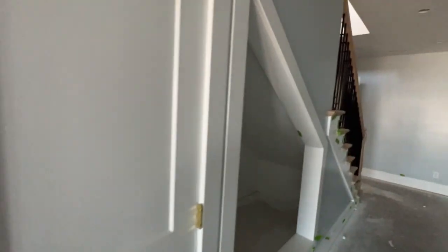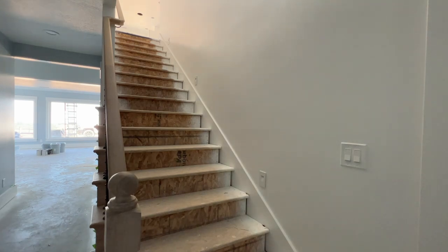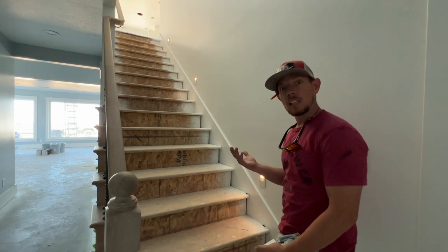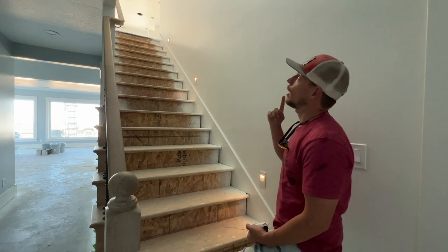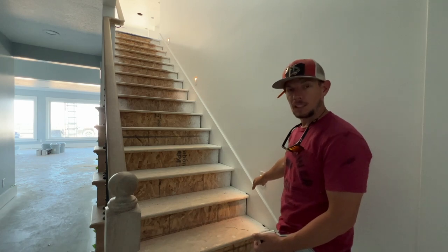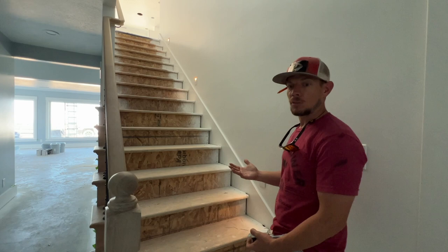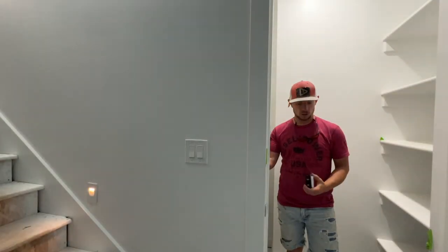The whole reason I got this switch is for just this hallway by itself. These are just kind of the only night light we're going to have in the house. We will have evening lights, but we like things turned off at night. Since this hallway is kind of tucked away, I just wanted some sort of illumination on this hallway that's really mild — not a main light that has to be turned on in the middle of the night if you've got to go up or down the stairs. You don't wake the whole house. But I don't want to turn these on and off manually either. You have the option of a photo cell, but a photo cell has to be visible out here and I didn't want that. I wanted that hidden look built into them. So that's where this switch comes in — it can turn on and off when I program it to, and then I don't have to worry about it. Set it, forget it, and it's hidden away back in this closet.